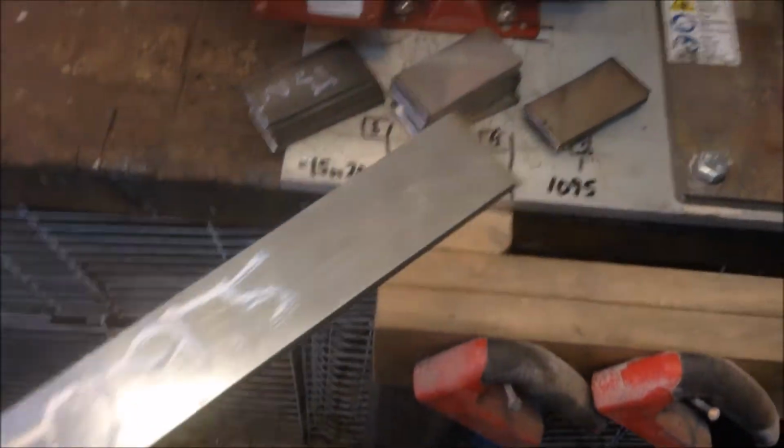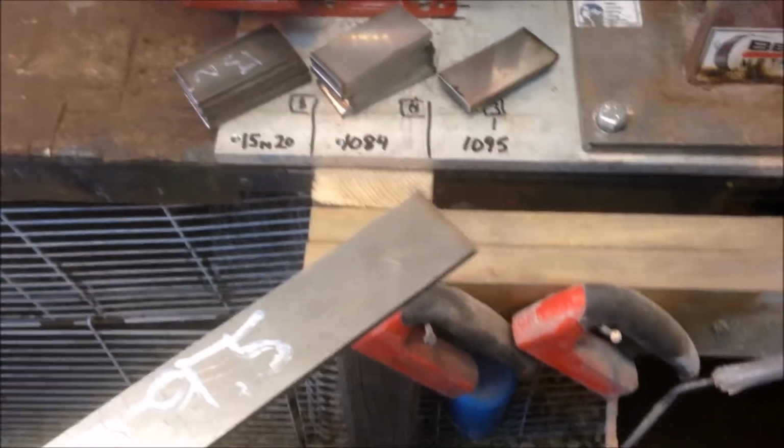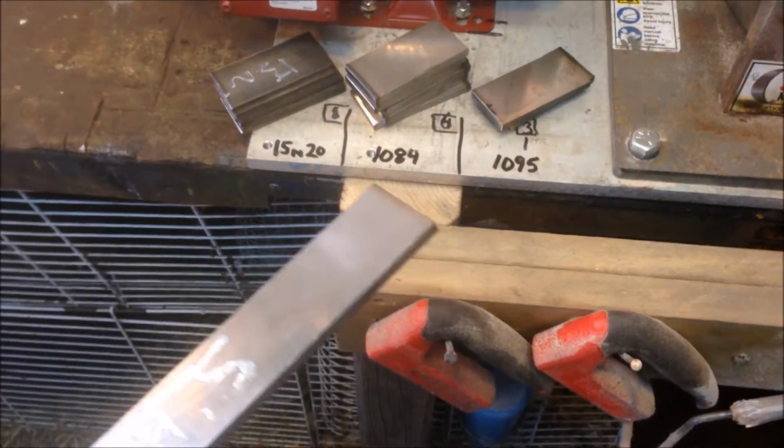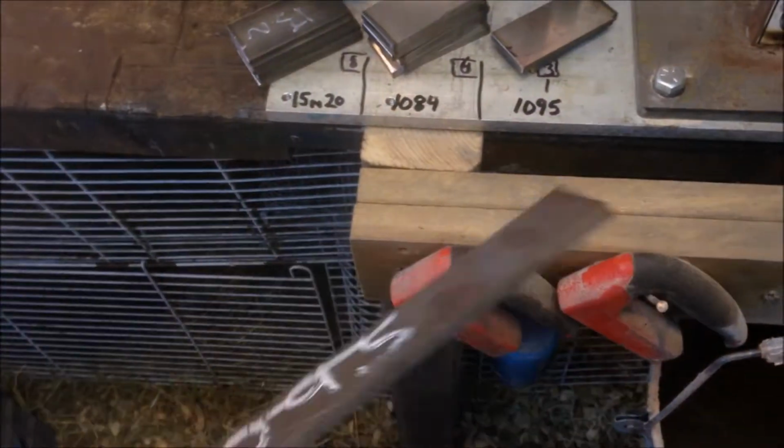I don't know why people who do Damascus struggle over this. They're always welding on a bar to hold onto it, and it's always breaking off, and they're always complaining about that. The way to avoid that is to use a piece of long stock and actually make it be part of the billet. In the end, I just cut it off, but it won't break off during the process. Trust me on this one.